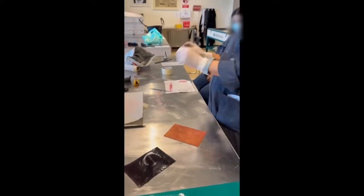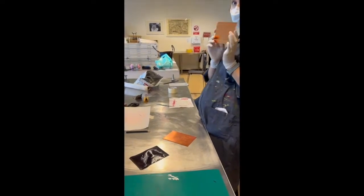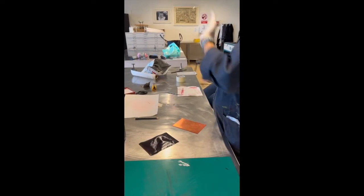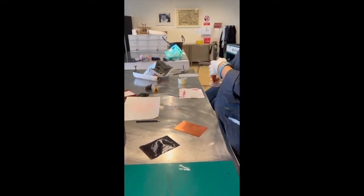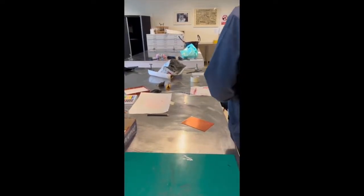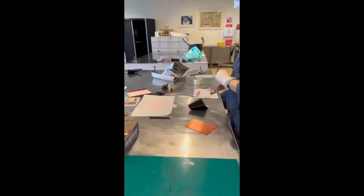We can't just put it in the chemical like this — what will happen to the back? The chemical will attack that side too. While it's not the end of the world, it wastes the chemical strength — it gets weaker. Also you can't use the back side later if you mess up. We need to cover the back properly. I wish we could just leave the original protective layer on, but because it has to go on the hot plate, it gets wrinkly, so we have to take it off and put a new piece on.